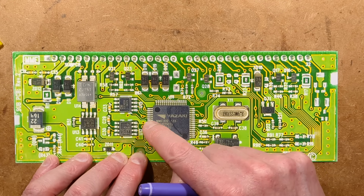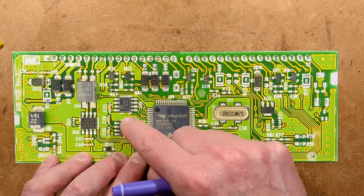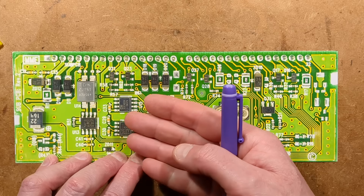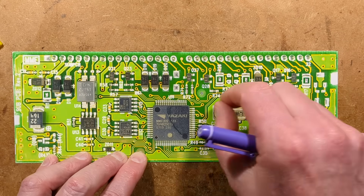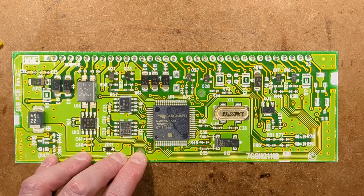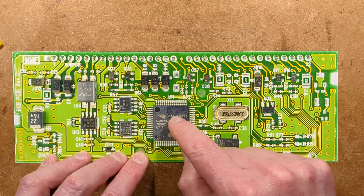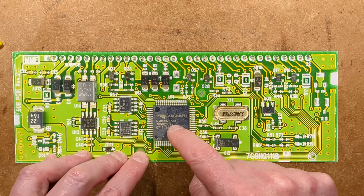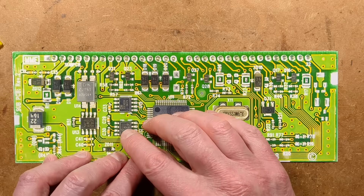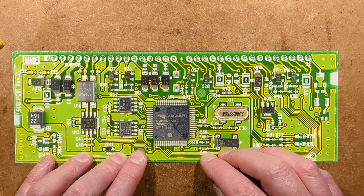I'm removing it. There's not too much in the vicinity - a few surface mount components - but they could be masked with Kapton tape, and then you could just use a heat gun and flux to heat up and swap the chip over. Optionally you could just store what's on this chip or swap the chips over. This chip here is a watchdog and voltage monitor chip - it provides a nice clean reset if the power starts going down to the point the microcontroller could get unstable. It's a watchdog, meaning the microcontroller has to keep pulsing to say 'I'm awake' - if it stops, this will reset the chip in case it ends up in an unknown state.